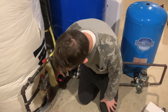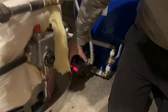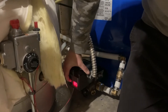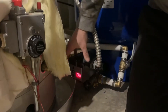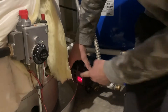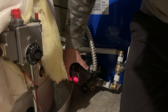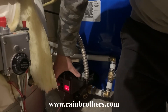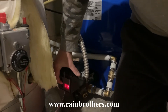To adjust the pressure switch, all you have to do is push this middle button and hold it down. It'll say 'low' — or '07' if you're reading it upside down — and it'll show the low pressure cutoff point, which in this case is 40. If I want to increase my pressure, let's say I want to increase it to 50, I just hit the up arrow.